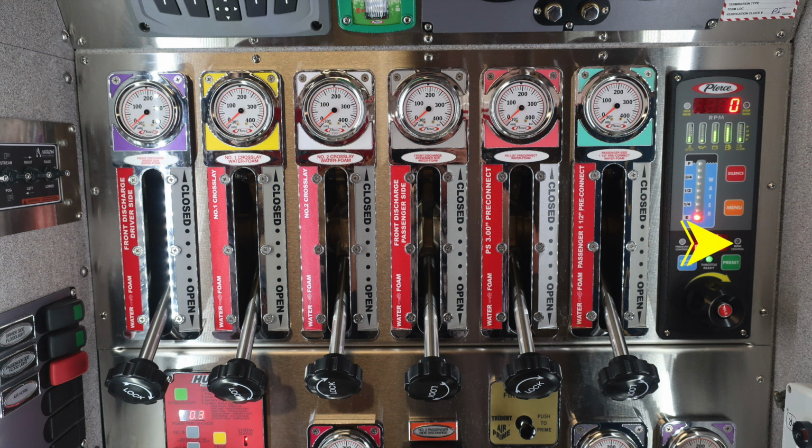There's an indicator for both on each side of the digital readout, currently indicating engine at idle. This is your RPM control if illuminated, and as we move down to the left in blue, this is going to be your control mode, and that's how you select between the two operations. Located in the center, you'll find an OK to engage the throttle, that your throttle is ready, and on the right in green, you have the ability to set presets for your engine operations. Located in the center of the turn, you'll find a push in for idle, and then you can turn right to left for increasing and decreasing your engine.